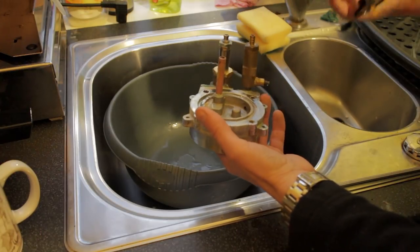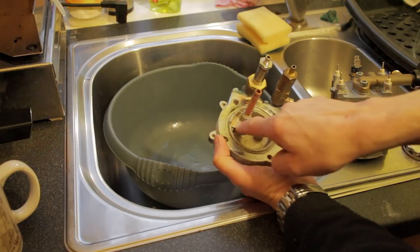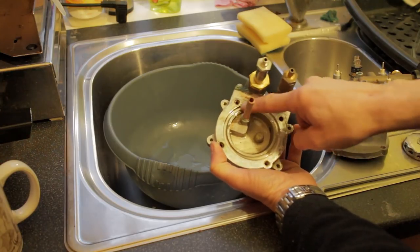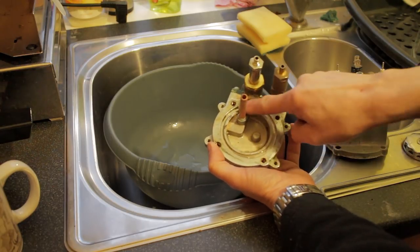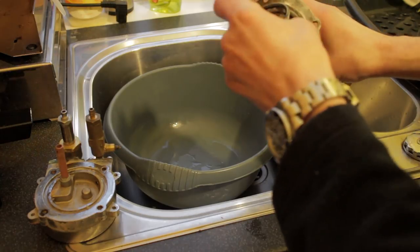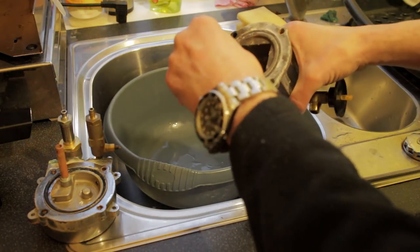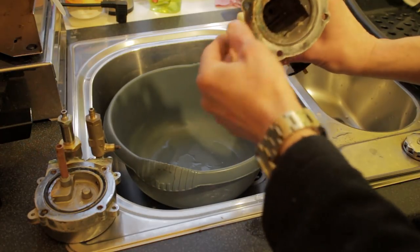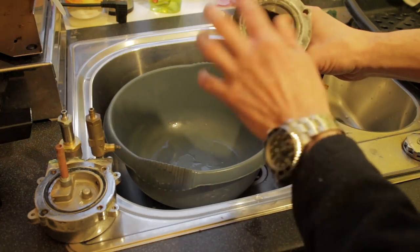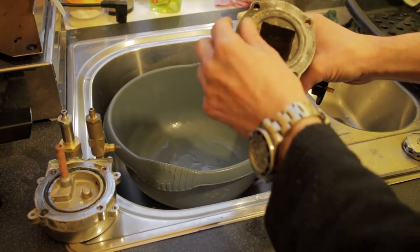The bottom plate popped apart much easier than anticipated. You can see the feed tube - there is actually a build-up of some gunk in there. It's not too bad but there's definitely a bit of gunk and a little bit of galvanic corrosion, so this needs a clean-up before it gets reassembled. The boiler itself has a gasket there which doesn't look too bad. There's definitely a bit of build-up and corrosion in there - not too bad, but it certainly could use a good soak and clean-up. The mating faces also show some galvanic corrosion between the two different metals.